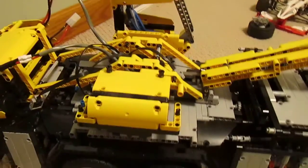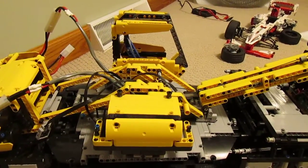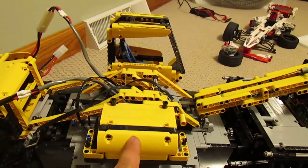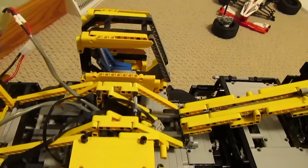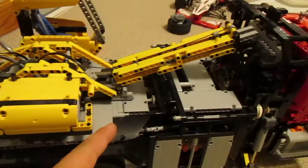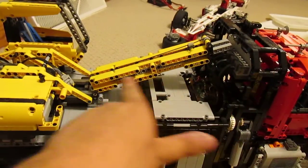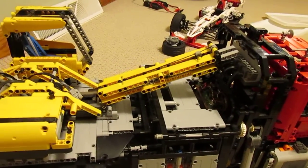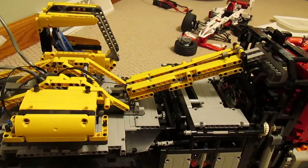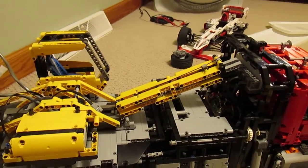For this whole crane unit, I like the operator's cab — I think I'm going to stay with that, and most of this I think I'm going to stay with. Right now, how the lifting and lowering of the arm works is I have two XL motors in here, which are geared together and then operate a small winch. That string is connected to a sort of linear actuator. It's kind of interesting but I don't think I'm going to stay with it. Instead, what I think I'm going to have is a trolley mechanism attached to the underside of the sleeve, connected by a rigid arm, and then the trolley is pulled in and out to raise and lower the arm.